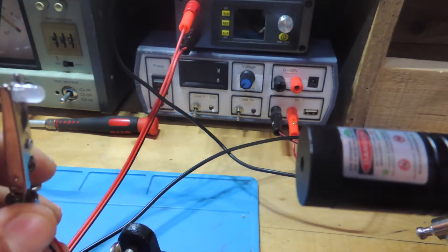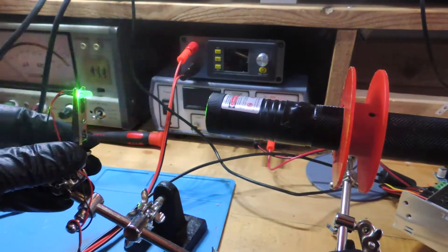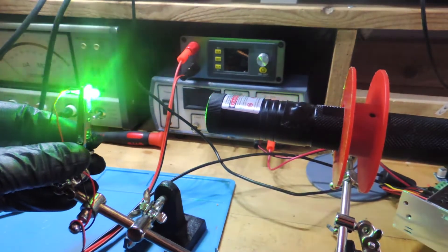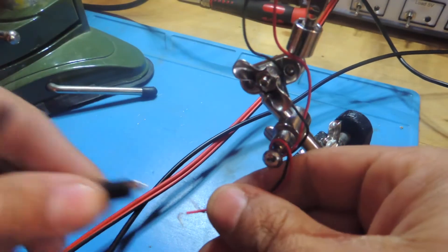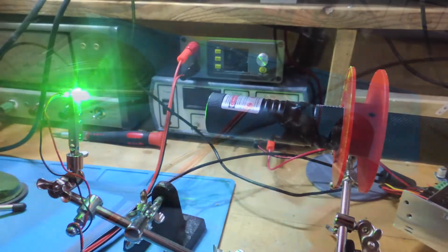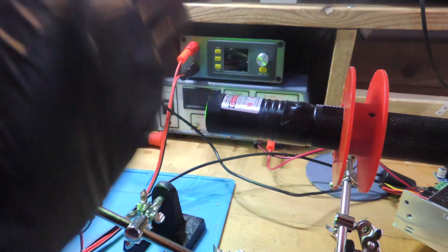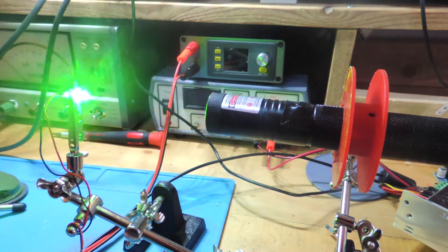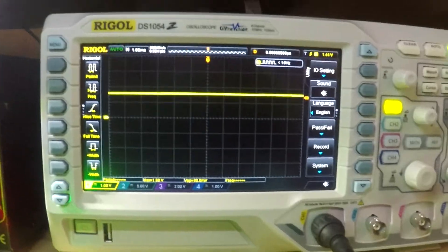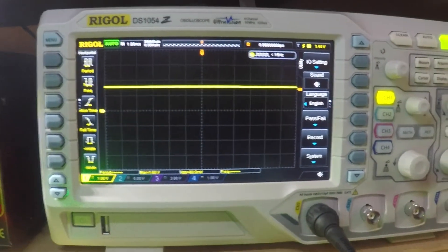The principle of what we're going to do today is quite easy. An LED can emit light but can also sense light. That means if you hook up our oscilloscope to the leads of the LED and point the laser towards the LED, we can see the variation of voltage in the LED. This light in the LED is actually from the laser, and on the oscilloscope you can see the variation of voltage when you block the emission of light from the laser.